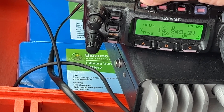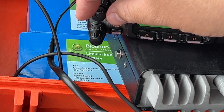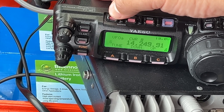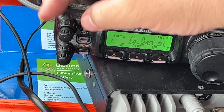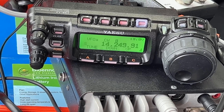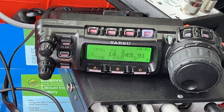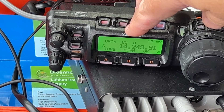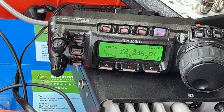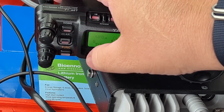I don't hear anybody. What I want to do is put it in CW mode — they say you should have it at 10 watts or below. You could go up to 100 but that's not very cool, especially if people are talking. So CW mode, 10 watts, already did that. I'm over here at the menu for tune. I have my Tar Heel 75A outside, so all I need to do is press and hold this button here for about two seconds.